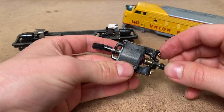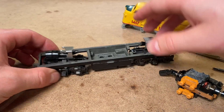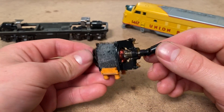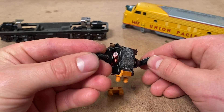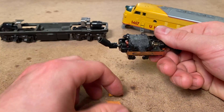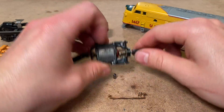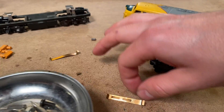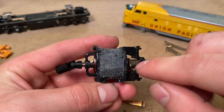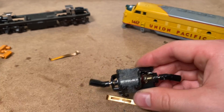There's our motor and it's completely seized. I'll check in on the drive — both are turning fine. So this problem is entirely with the motor and whatever is going on here. The brushes themselves look fine, but the wear marks on the motor are very odd — they're almost in a spiral pattern — so something clearly just went very wrong on this motor.